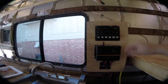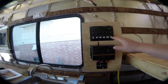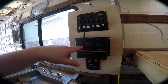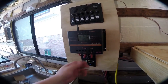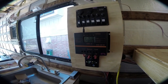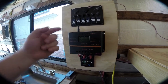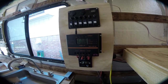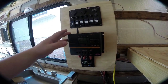This is our DC control box. At the bottom this is an on and off switch — a remote switch for the inverter. It gives you battery level and stuff like that. This is a little PWM charge controller. As you can see we are pulling in from the sun almost 20 amps right now, steady state, with nothing on the load. So this goes to the battery and this goes to the load. The load basically runs down to our DC bus bar. The battery runs all the way down to the battery. You can see our batteries are at actually almost 80%, and we are just cranking it down. This thing gets a little warm but not too hot — I cut out the back side so it's got plenty of ventilation. All in all I'm very happy with this.